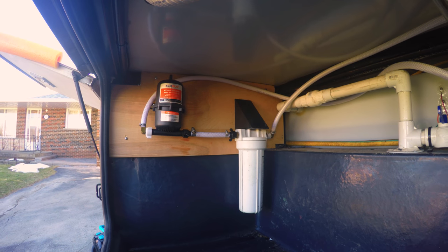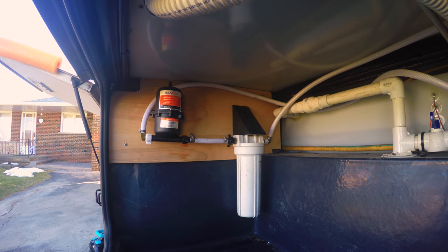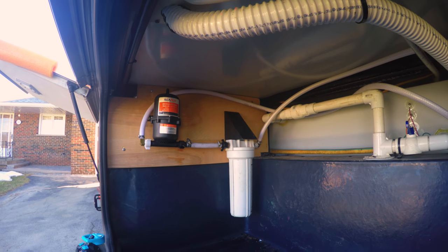All in all, I'm satisfied. For $40, I have a quieter water pump now. The only downside to this accumulator is that it gets louder just before the pump cuts out. I might be able to improve this by putting more air in the bladder. All that's left to do is take it apart, paint the board, secure the lines with wraps, and straighten the tank during final assembly.